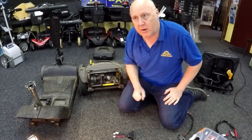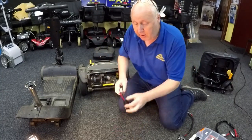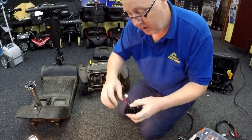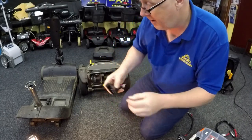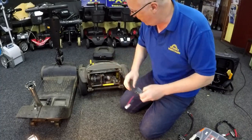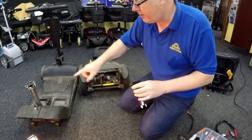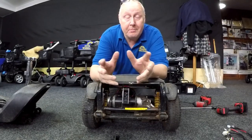When I tell people to check connections they don't check them closely enough — the plastic is very important. Some pins are hardwired to the connector; some have a nut and bolt so you need to make sure the connection is clean and the nut is tight. Some rotate so the connections are good, but with uneven surfaces the metal starts to wear. When you put these on, don't put them on too tight — make sure they line up neatly. If you put them both on too tight they may not line up properly.